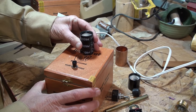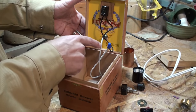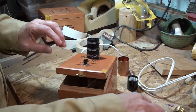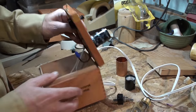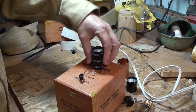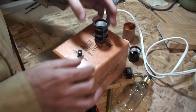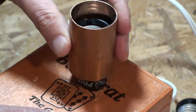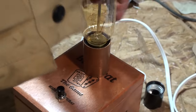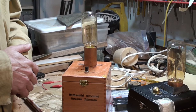First you drill a hole appropriate for the threaded rod to go through, which you thread into the bottom of the socket. Put a locking nut on both sides so you can get it really secure. It goes through the hole you drill for the little switch, and as I say you can use any switch you want. Drill a little hole out the back for the power cord. I then wrapped this with some black industrial duct tape — a couple of rounds to make sure it's fully insulated and none of the wires touch the edge, and to make the sleeve snug enough so that you can get it on and off but it stays on. Screw in the bulb. The whole thing took maybe half an hour to do.